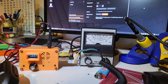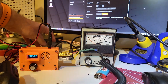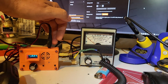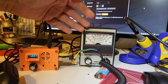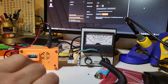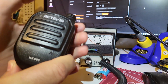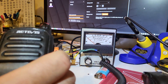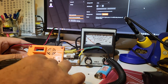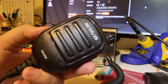It's all plugged in. I have my wattmeter here — the WM2 — and a dummy load in the back, because you should always use a dummy load. Even if you're not planning to transmit, when you turn it on there could be a short in a jack and it could go into transmit immediately and fry your transistors. The dummy load is plugged in. Let's turn on the microphone — we get sound. Now let's see if I transmit — I'm in CW mode, but at least the PTT works. Switching to USB mode and talking, the needle moves — we have a working microphone!